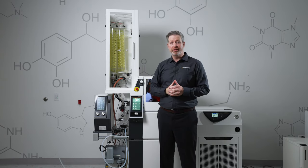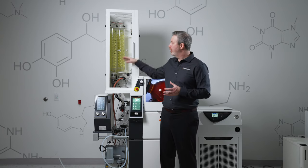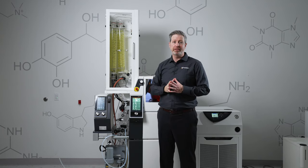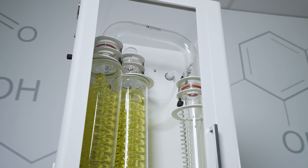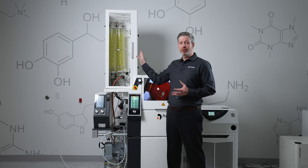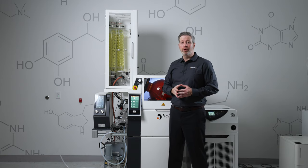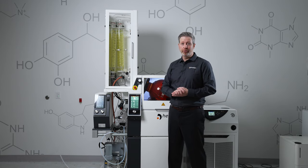On the vacuum pump, we have a tertiary condenser, and that condenser serves to trap volatile terpenes that may race through the system before they condense. One of the strengths of the HyVap Industrial is the precision of our glassware. Not all glassware is the same — we use Schott-Duran borosilicate, and the result is a very tightly sealed system that holds vacuum with a very low leak rate.